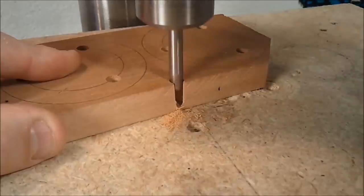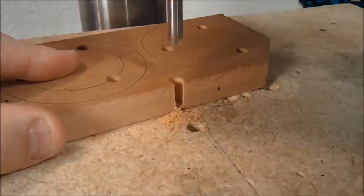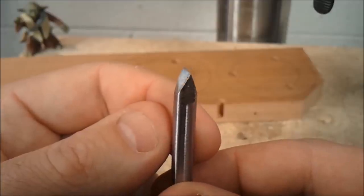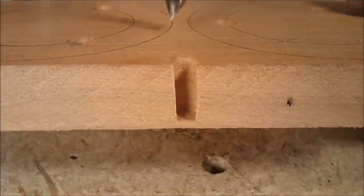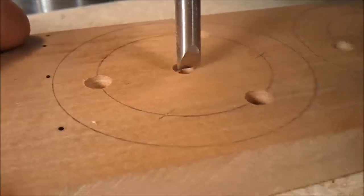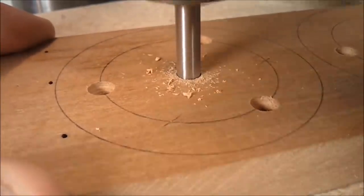One of the two center holes has to be drilled as deep as possible. I'm after a hole that leaves a little more than a sixteenth remaining, and I want the hole to have a flat bottom. To do this, I sharpened a piece of the quarter-inch rod that I'm using for the posts into kind of a drill bit. So first I drilled the bulk of the hole out with the Forstner bit, then I used the specialty bit to just scrape the bottom of the hole clean.